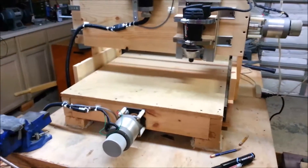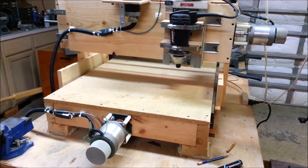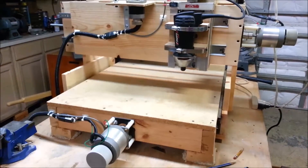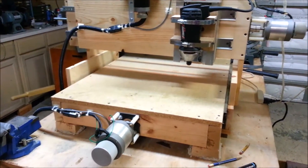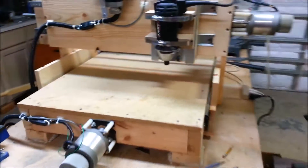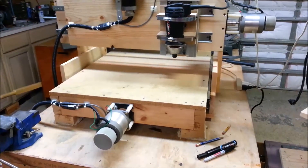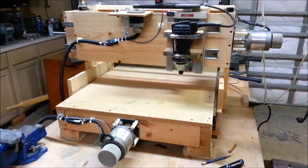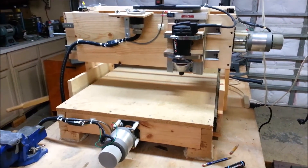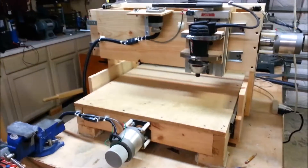I've got a few other things I need to do. I have ideas on how to level the table — if that idea pans out, I may make another video about leveling it. The idea is gluing about nine wooden bosses or hard plastic bosses on here, then machining them all to the same height with the mill, and bolting the table onto them. That way I don't have to machine the whole table to the same height — pain in the butt. We'll see if that works out, and if it does, I'll make a video of it.